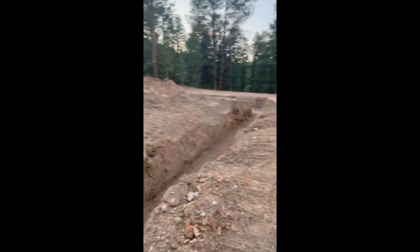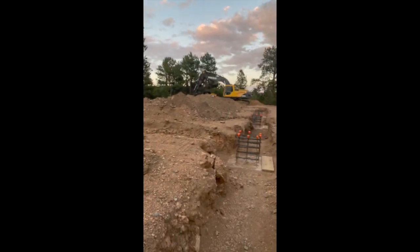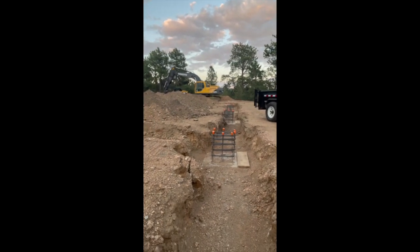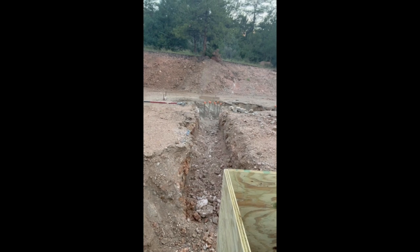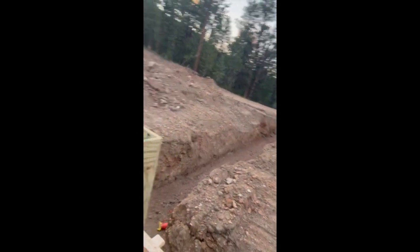Overall it went pretty well. I got the line drawn across to find center with them and build the form right and center so they line up. These things mostly go from a big beam arch, and then we have four of those along on each side. Those arches are the main support of the building. The end walls are not so supportive - they do their job mostly in shear. Coming along, just gotta wrap one more around. I got all the boards cut for that side to build too.